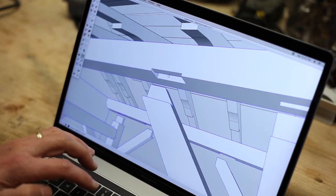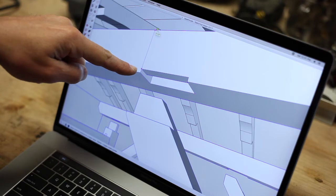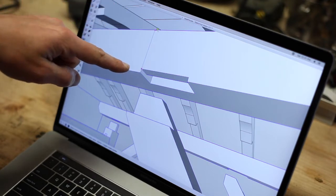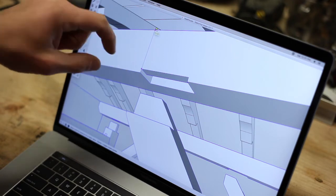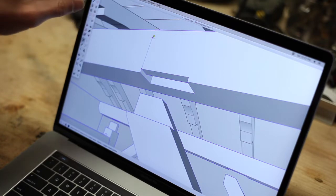When it comes to the corner braces, this is the biggest thing I've learned since the last video. We have this housing right here, and it's measured down a half inch, but that's really not the important measurement. The important measurement is to come from the top of the beam down to five and a half inches, and what that does is allow any variation in the beam thickness to be absorbed by this housing. So if the beam is perfectly six inches, we'll have five and a half here and a half inch here — but if the beam is over or under, this housing may increase or decrease in height.